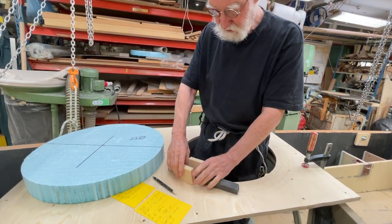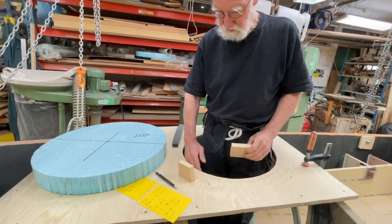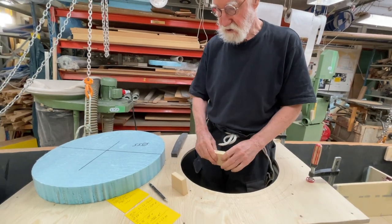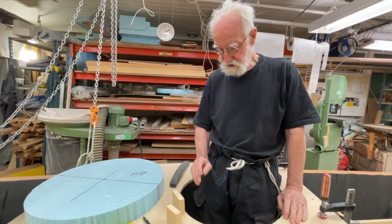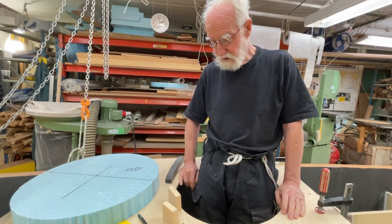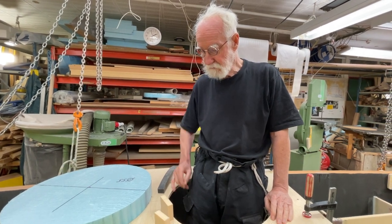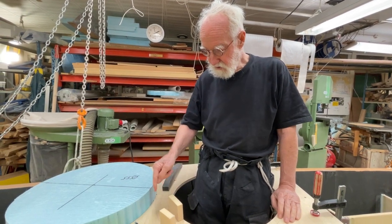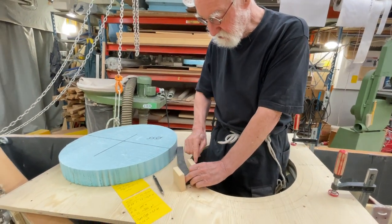Before, I made a mistake — the lid of the combing was coming up like this and it was not insulated, so I got a lot of condensation up in high latitudes near Iceland, and it was dripping water for like a month. It got condensation and mildew and it was terrible. But now, just by a little bit of changing, I got the lip from this one on the outside here and I still got the insulation here.